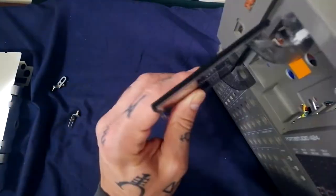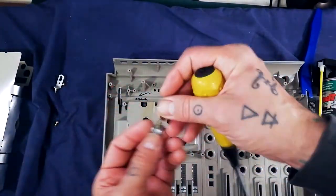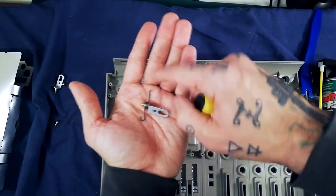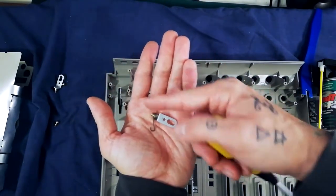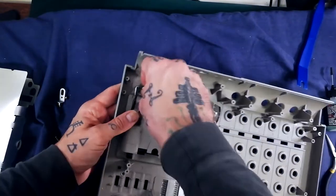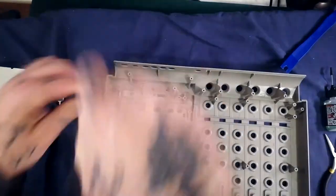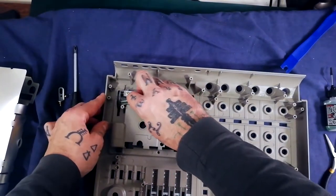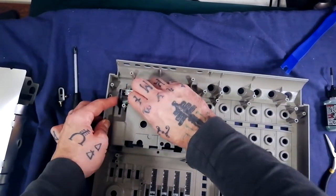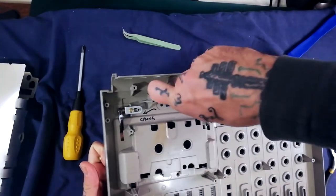When replacing the door, put the spring back with the U-shape on that side and the tiny L-shape on the other side pointing upwards. Slot it into the door first with the U-shape dangling down in the space — it's not on the door yet. Screw it down, then use tweezers or a screwdriver to grab the U-shaped end and slot it around the door hinge. It'll work a bit wonky until you get the other pin in and screw that down.